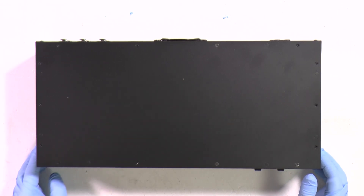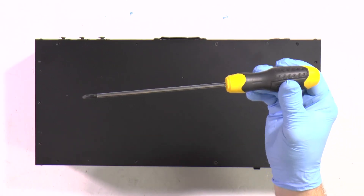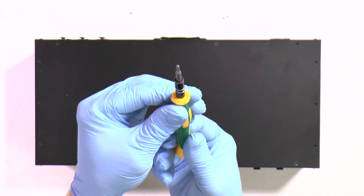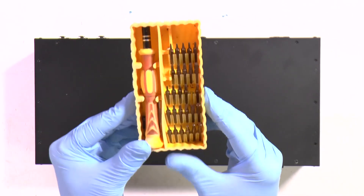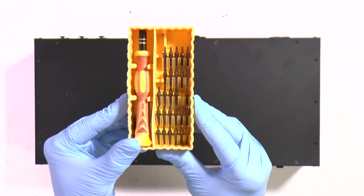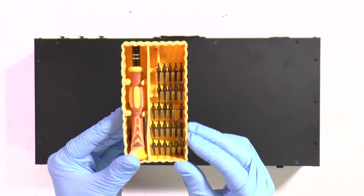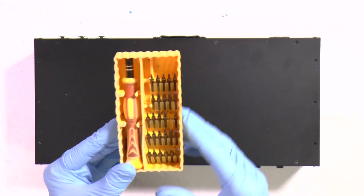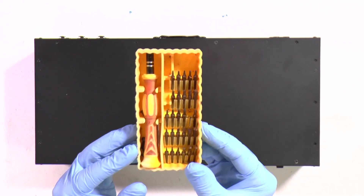THX1800 3-Way Active Speaker System Kit assembling instructions. For assembling you need a Phillips screwdriver, type PH1, full name S2PH1 - this is a common standard. And you need a 2mm hex, technical standard H2. In the Home Depot you can find sets with bits that include the 2mm hex and PH1 bit. You can finish your project with those cheap sets - this one costs about 7 euros.